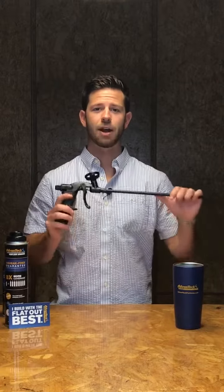To get the most out of your applicator gun, we would recommend that you run cleaner through it for every six cans of Advantec subfloor adhesive that you use.